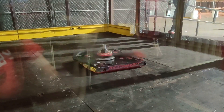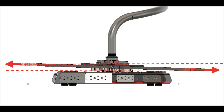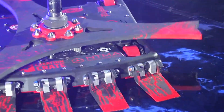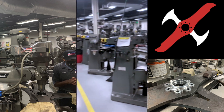Any tiny missed tolerance can result in a horrible wobble called a dynamic imbalance — basically when the weapon is balanced while standing still and unbalanced while spinning, due to inconsistent heights between the two sides causing uneven accelerations. To help us with that, we went to our new sponsor this year, NTMA. They were able to fixture our blades in a big milling machine and machine out the center bores with amazing precision.